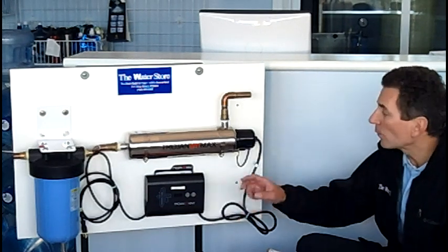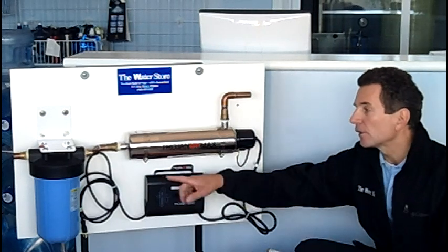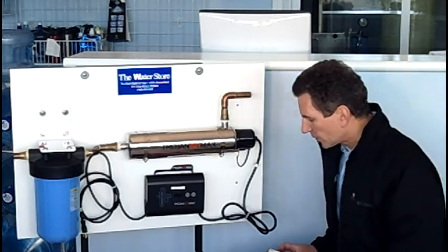It's a simple unit and once you know how to do it, it's pretty easy to change the filter and the ultraviolet bulb so you can easily do it yourself. The first step is to make sure you've got everything to do the job, because once you shut off the water and disassemble this unit, you don't have any water in your house. It's a good idea to plan a little bit of water ahead — maybe fill half a bucket that you'll use for cleaning the filter housing. Prepare that ahead of time and prepare all the things you're going to need.